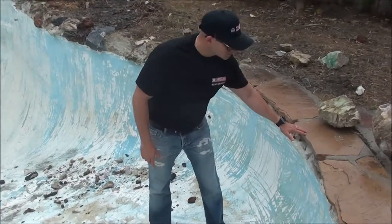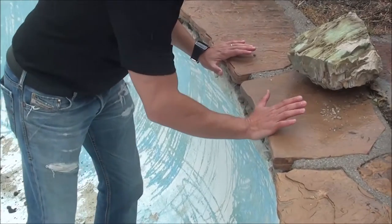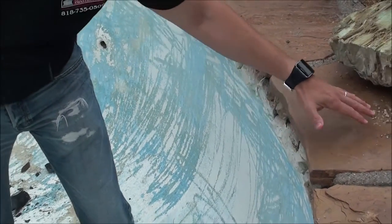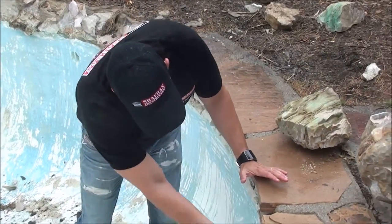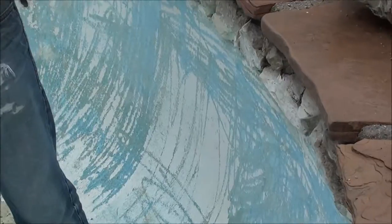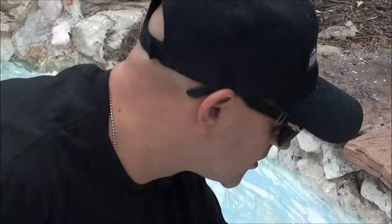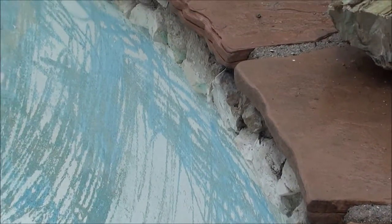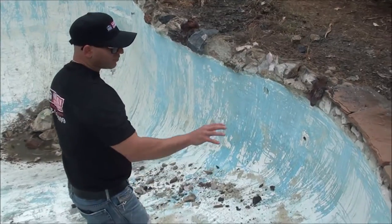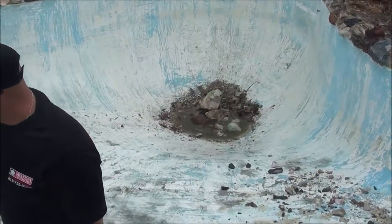This is the coping. This type of coping is not really recommended if you have little kids, because when they're in the pool and want to climb out they can cut themselves. We definitely recommend some type of bull-nosed coping that extends a little bit into the pool. On the bottom of the coping you can see this is a flagstone or slate design — it's more of an aesthetic look. For couples or other individuals who prefer this type of look, it definitely gives a nice earthy finish.